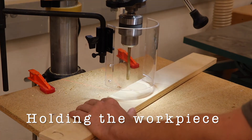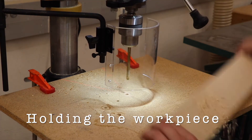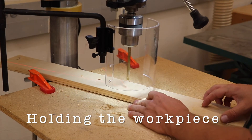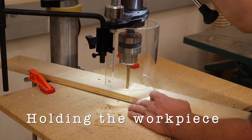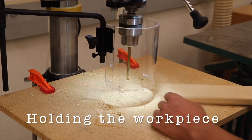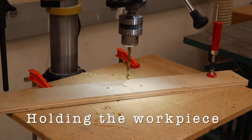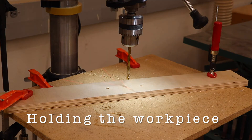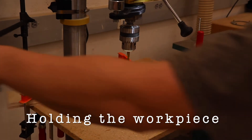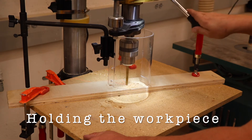Whenever using the drill press, it's important to hold the workpiece securely. If you're strong enough and have a big enough board, you can hold it against the table yourself. But with bigger drill bits, it may want to twist or spin on you. In that case, you can take a longer piece and put it to the left-hand side of the rear post, which secures it against the post in the event that the bit grabs it. Our preferred method is using clamps — clamping the board down with F-clamps allows me to have my left hand free and operate the drill press with complete confidence that the board will not be grabbed, spun, or ejected. This is the best way to work.